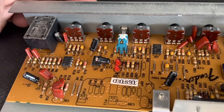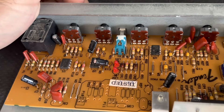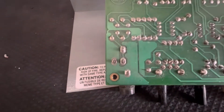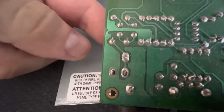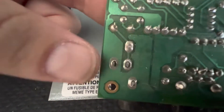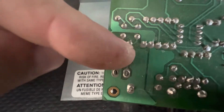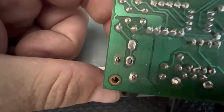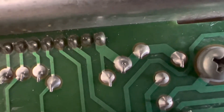Let's see what we got in there. As expected, that's pretty wobbly. So, probably go under there and reflow some solder. Looks like everything else is loose — look at the whole board move. Alright, I know all you sick people out there in YouTube land like to see carnage, so here it is. There she blows. Look at that — oh my... Every single one broke. Even this one here. That one right there broke underneath. Just looks like there's something, but there is not. Look at that one there — look at that little guy. A hole right there.